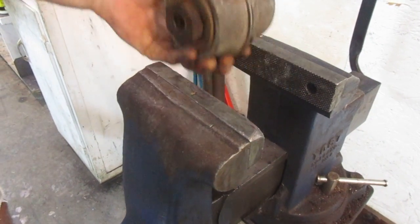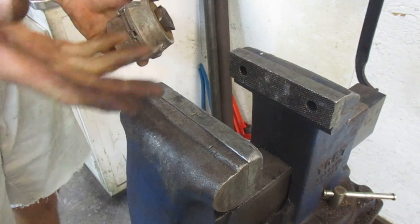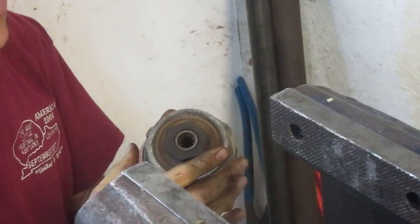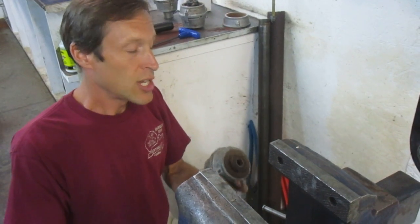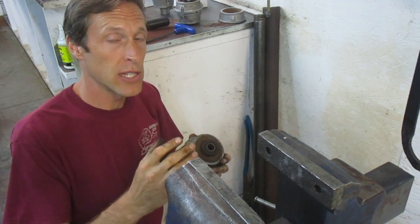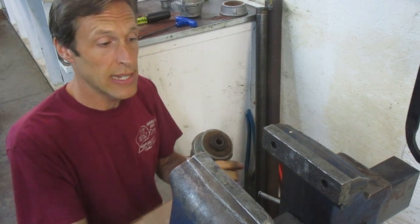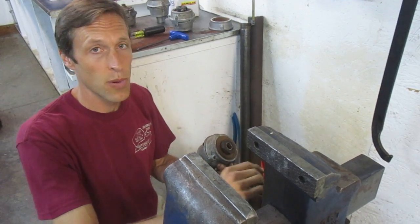The other failure a clutch will have is when it does not transfer power — that would be the clutch slipping. When you've released the clutch and it should be transferring power to the machine, the implement or wheel stops. That's typically because the lining of the clutch has been burned away. If that's the case, you now know how to take this style of clutch apart so the lining can be replaced. Also, if a clutch gets overheated badly enough, it can actually damage the inner spring by taking some of the temper out of the spring, so it won't expand as much and won't have as much pressure to push the facings together. If you have questions about whether your inner spring is damaged, you can call us here at Earth Tools and we can measure a new clutch spring for comparison.